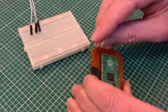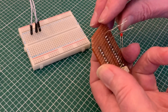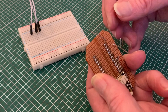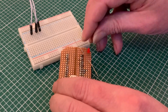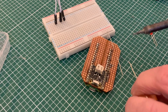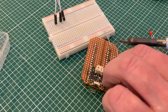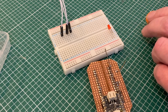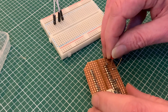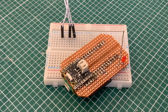The last piece of circuitry that needs sorting is our flashing red LED and its accompanying resistor. We're going to need the row on the circuit board beyond the end of the Pico — the long leg of the LED will go to pin 16, with the shorter one using that extra row going back to a ground pin on the Pico via the resistor. The resistor can be soldered through the board in the normal way, but the LED is more challenging — I need it on the front of my board so it shows through the plastic case when flashing. So I've put a blob of solder onto each of the legs and carefully melted that onto the surface of the board underneath the bulb.